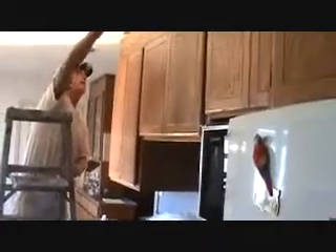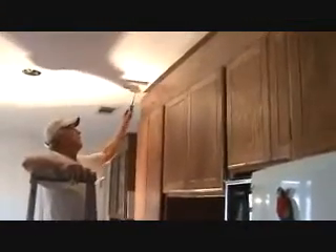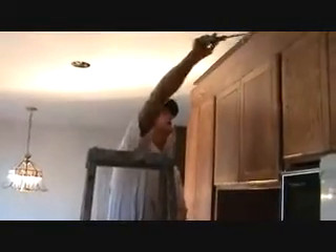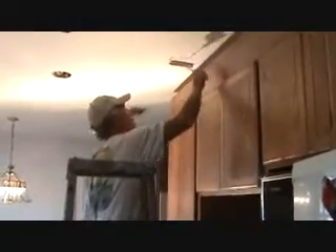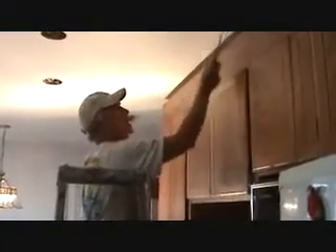Some people paint doors with the sponge mini rollers — what do you think about that? I haven't had much experience with them because the sponge rollers leave a little bubbling effect. I like the velour type rollers — they seem to lay the paint down flatter on the surface. You still get a textured look to a certain extent; nothing's perfectly smooth. If you want something perfectly smooth, you're probably going to have to spray it.